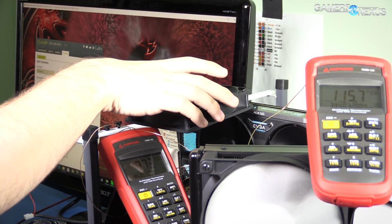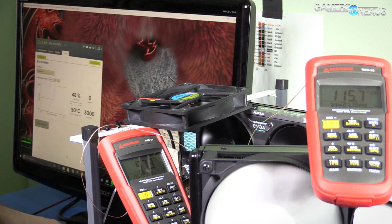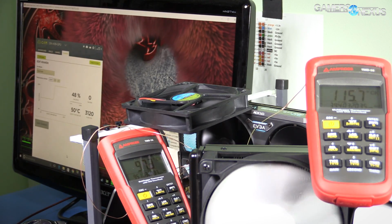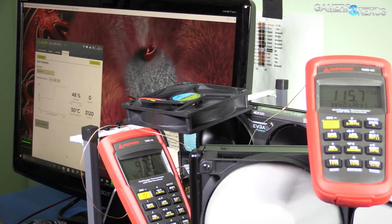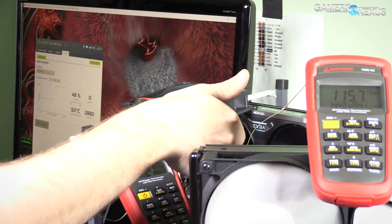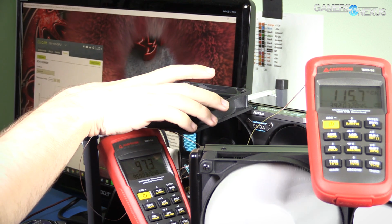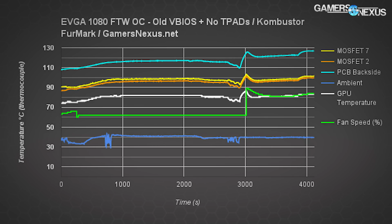Another test I tried was connecting a case fan pointed strictly at the GPU, such that the GPU could run a colder temp and thus a higher clock and lower fan speed, but in a way that the VRM would still be incinerated by a lack of cool air because it's, again, directional. So that was the footage of some of this going on, and here's the chart with the outcome. None of it worked. This chart is the worst of the two.